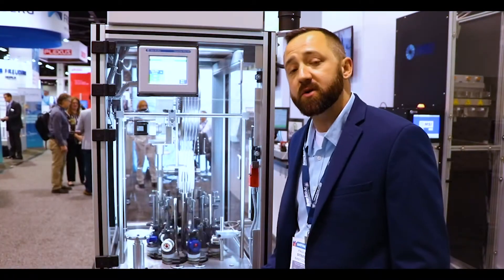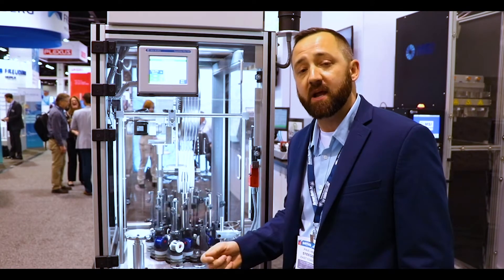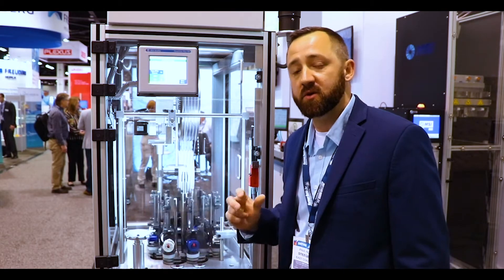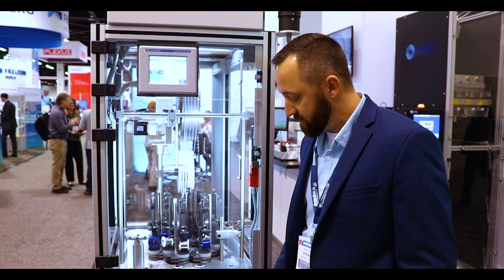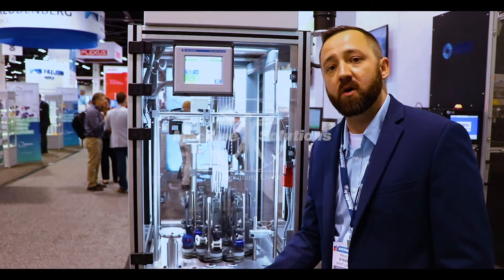You can also get a torque motor system if you need to control the torque of the take-up system and control the payoff. If you have a core that has a soft characteristic to it and you don't want it to stretch, we can customize that. You can see the button box here — you have a start, stop, a jog, and an e-stop. You also have your 4TK torque motor dial where you can turn the torque motor on and off.